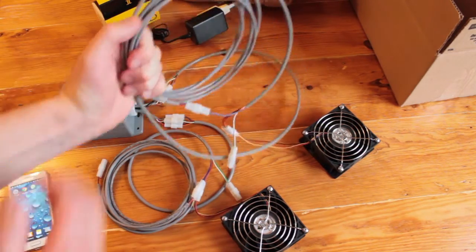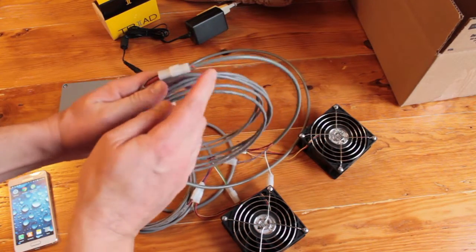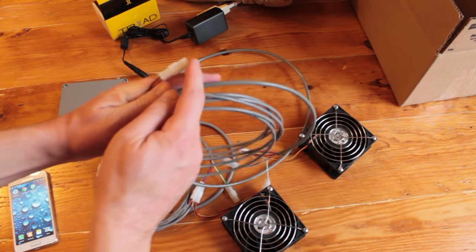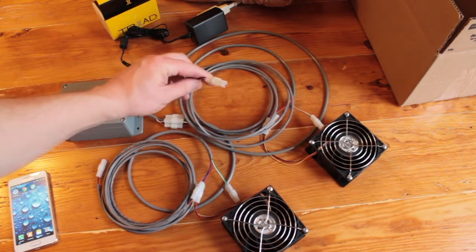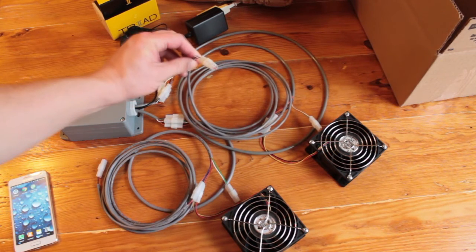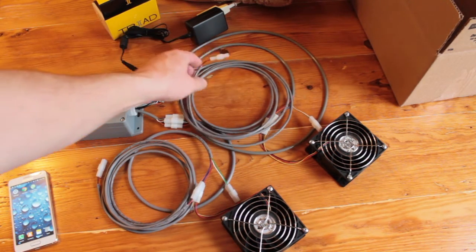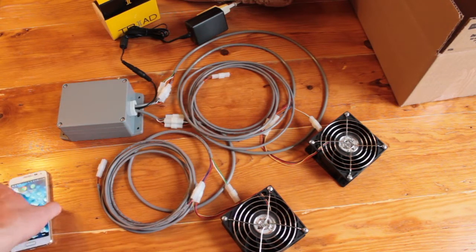The same applies for the second collector sensor wire — a nine-foot long extension. Put this into the inlet at the top and it monitors the temperature of the convected air as the collector is warming up. Once the temperature is sufficiently warmed, the fans will switch on, and that sensor then becomes a room temperature sensor.